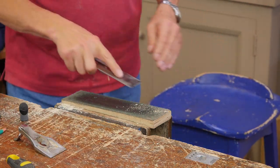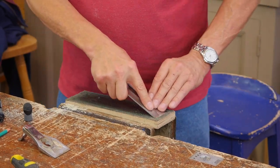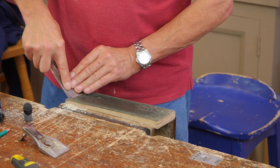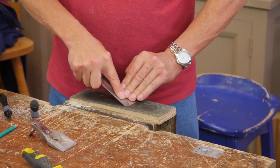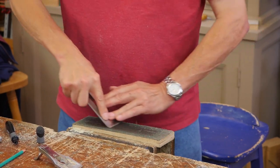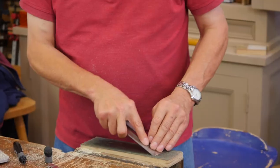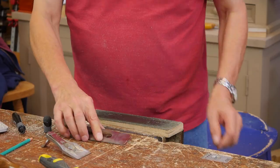When you start stropping on the strop here, a lot of times, this is what students do all the time, they're pulling here, and right on the very close, can you see my angle shifted? From 30 here, I pull and I do this. Like this. And I'm rounding the end of the plane. The blade is still sharp, but it's moved the bevel. It's moved that bevel up onto the edge. So when it hits the wood, it has no contact with the wood.